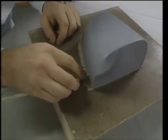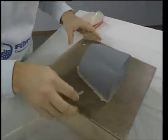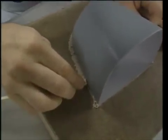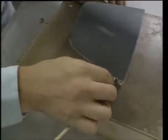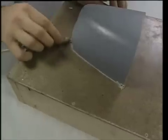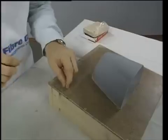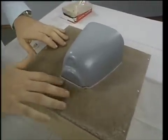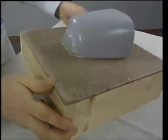Once the clay is pushed down into the gap, use a stick and push firmly down and flush to the parting board, wiping up all the excess. This creates a nice, clean corner from the parting board to the plug, which will be the mold edge. Now the plug is completely clayed, the crack and gap are completely sealed with a nice, clean corner, and the mold is ready to be waxed again.